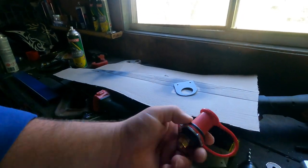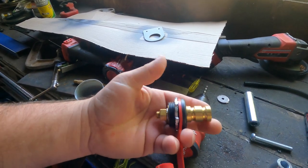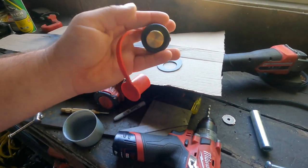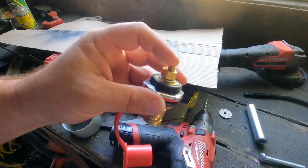What we're up to now is the most important part of fitting a winch anywhere — running a power lead from the battery at the front back to the winch. I've decided to add a few little features whilst doing this job. I got one of these — it's a jump start point — and I've made a little bracket for it. It's going to mount up under the tray and then I'll run a lead from the battery to the back of this, and then this to the winch.